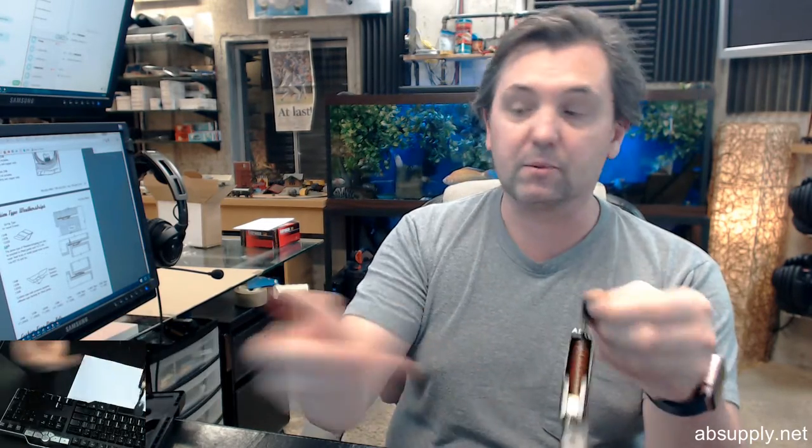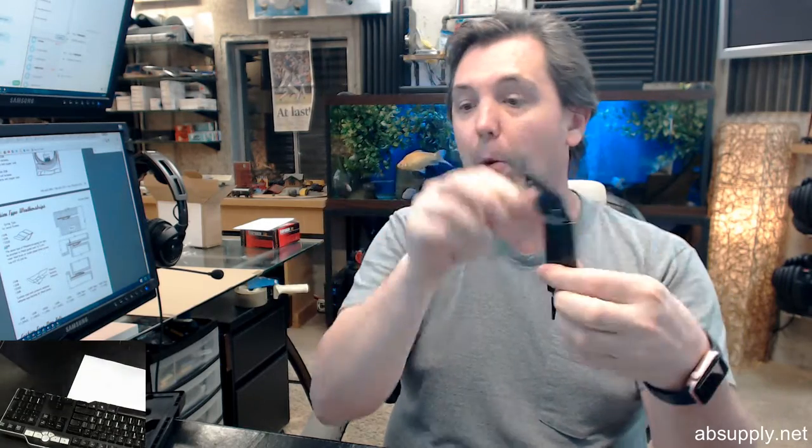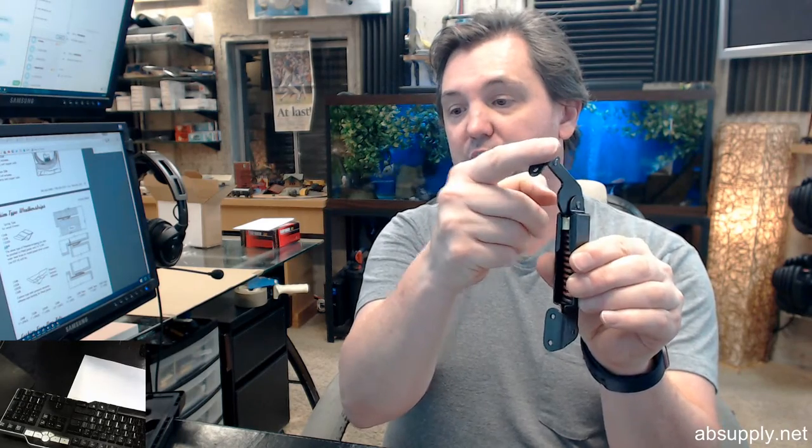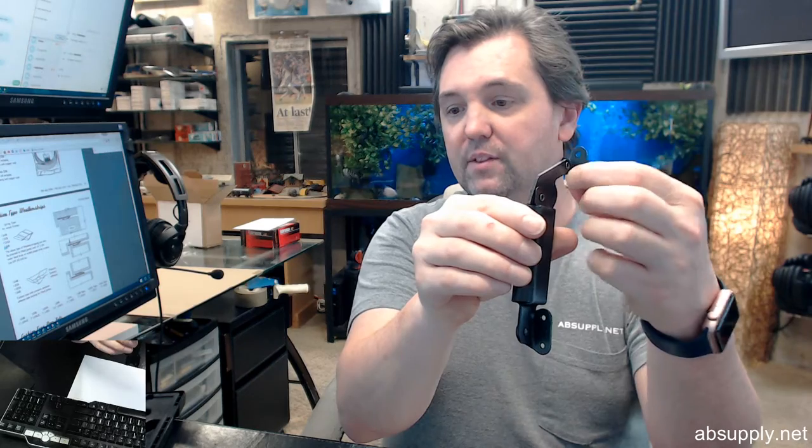Place bottom bracket so that the screw is 1/16 down from the top of the back panel. Fasten with a number 6 sheet metal screw. Secure second screw as well. Okay. Open lid approximately to 90 degrees. They want it a little bit closer to 86 degrees, it looks like. And place lid support against the underside of the lid with cover bracket flat against this surface. Secure with 2 screws as before. The distance from the back edge of the lid to the first screw hole should be 3". You're in.